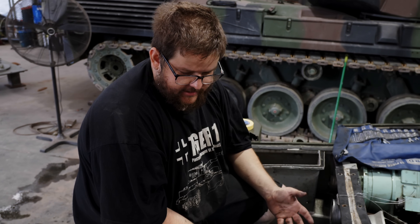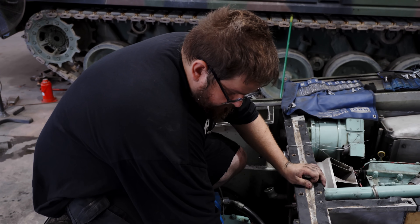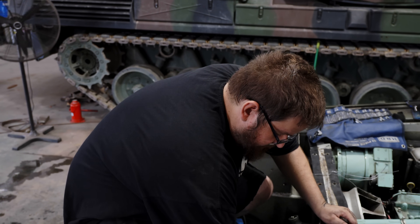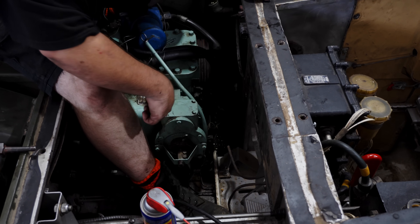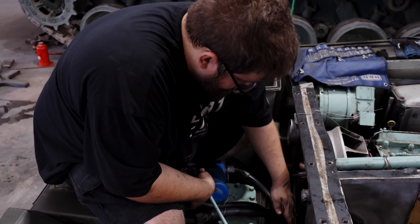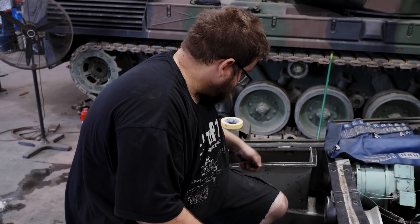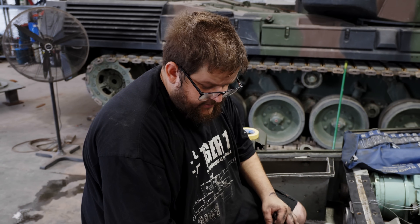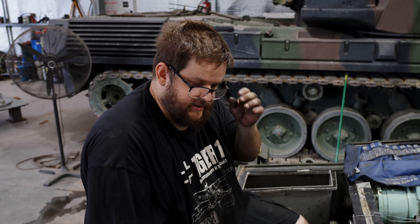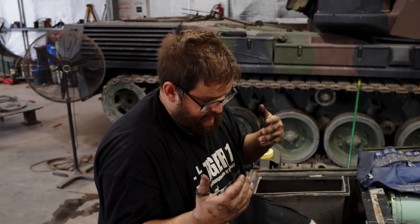There's been a bit of progress since yesterday. I've gotten a lot of the bulkhead fittings out. The zip ties are out, they run through. They put the bracket that holds the radiator down — that's out. Took the infill panel out. Now you can get to the brake lines, because they come down from the reservoirs, and there are two lines down there that join into the calipers. Calipers are going to stay on. I've undone all these fittings through here, pulled everything back onto the gearbox and tied it out of the way. Kept the dipstick — took it out, reconnected it and forced it backwards. We took the shafts out yesterday. At the moment, the only thing holding the gearbox in is its three mounts — two on either side and the front. Then we find the two brake lines and this thing is actually ready to come out. After that, we pull the whole gearbox out.